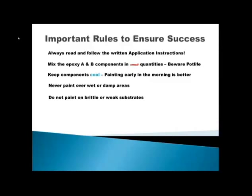Do not paint on brittle or weak substrates. In many cases where the marbleite has become brittle or soft, the epoxy will penetrate that substrate and create a hardened layer inside, and it might later crack loose when the marbleite is not strong or hard. Sandy surfaces cannot be painted — your plaster surface must be hard and solid and able to sustain a painted layer. The epoxy paint does set into a very hard glossy, almost porcelain-like finish — you can't scratch it or remove it by itself. But if it breaks loose from the surface it will normally be because there is a weak marbleite or plastered surface behind, and two or three millimeters of that sandy surface will break loose with the epoxy paint layer.